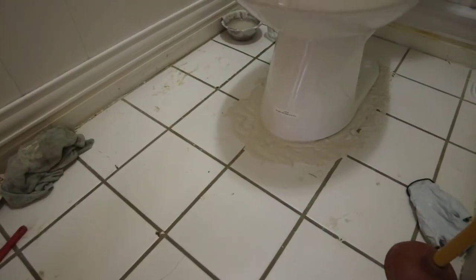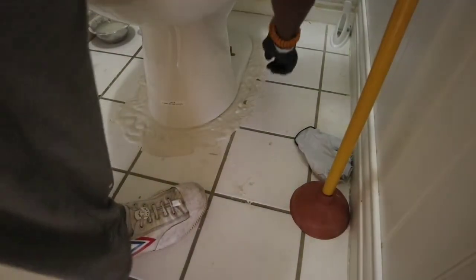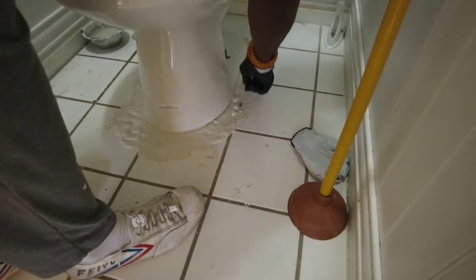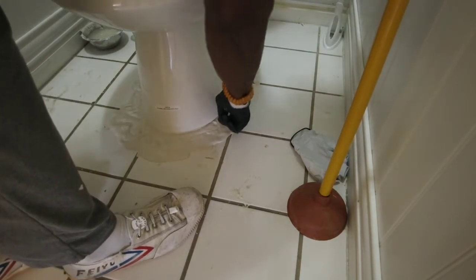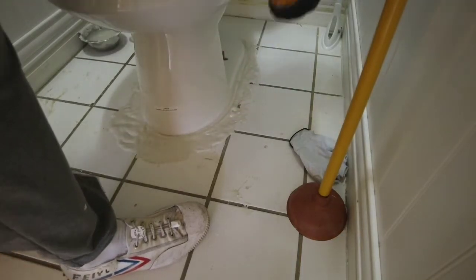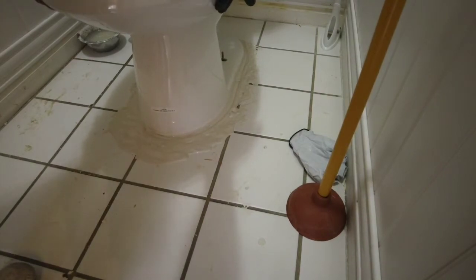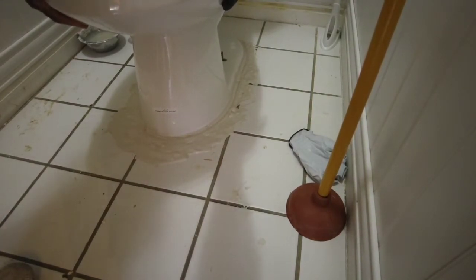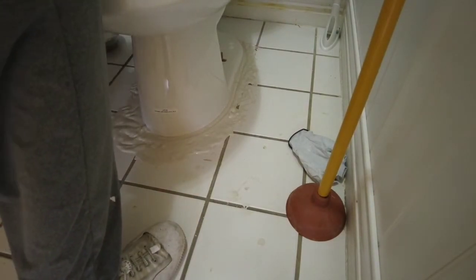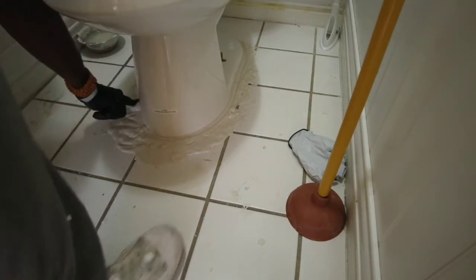So what I'm going to do now, first I made sure that the plaster's all the way on the outsides here, and it's so wet. And I want to make sure it's sealing the bowl. You don't even have to try to push it in or anything. Just rub your finger across the edge, separating it a little, leaving a space between the bowl and the plaster. And once again, look at this thing and make sure it's straight and to your liking before you lock anything down. Once again, get a nice smoothness around the edge. Make a little separation.